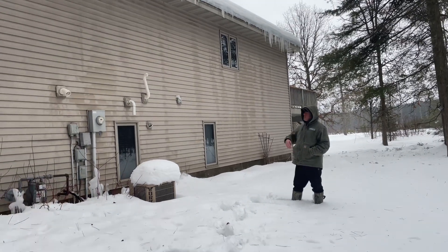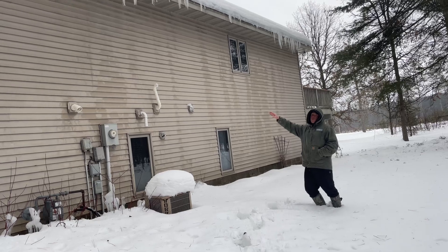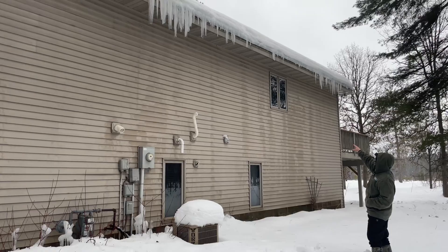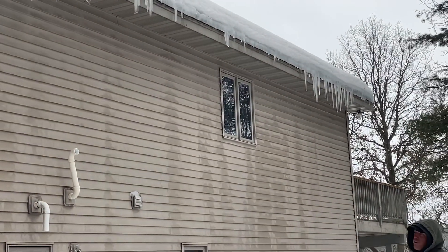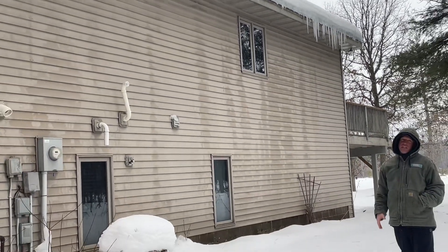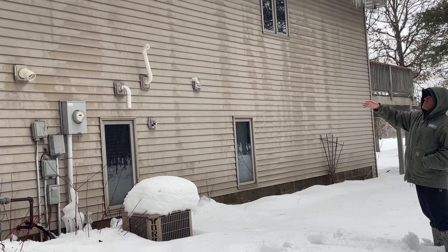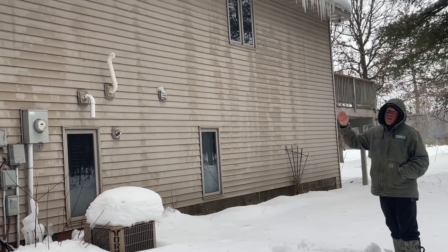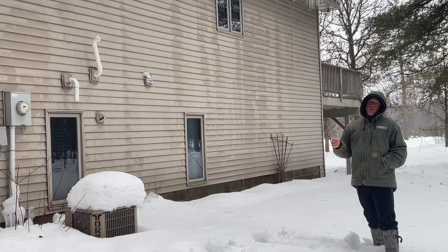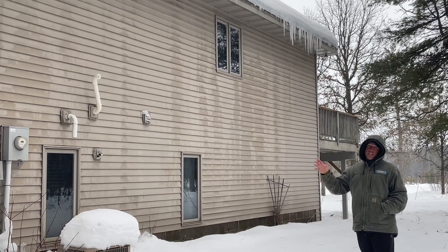So here we are at the back of the house. Taking a very quick look at the siding here, you can see how much water is actually on the siding. The leak is right near this window here in the kitchen area. If your siding looks wet like this at all, that's a great indication that the ice dam on that roof is holding water. The water is finding a place to come in down the siding, through the soffits. If you have icicles coming behind your gutters, through your soffit, down your siding — anywhere where icicles or water should not be — that's a great indication that you've got an ice dam up there.